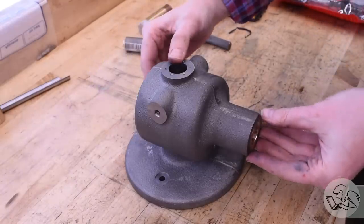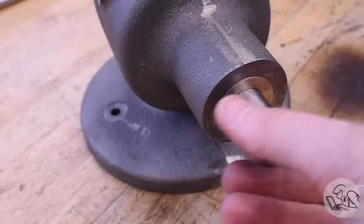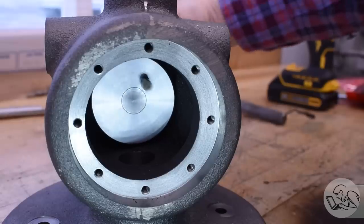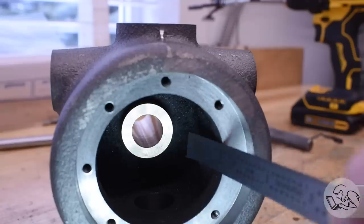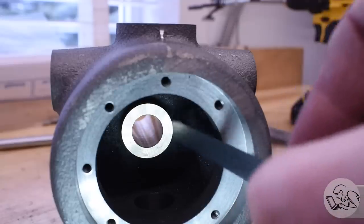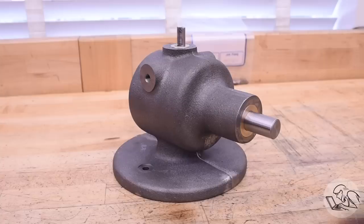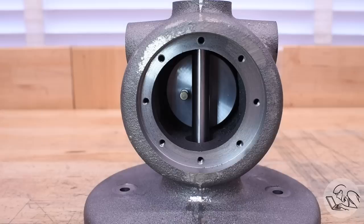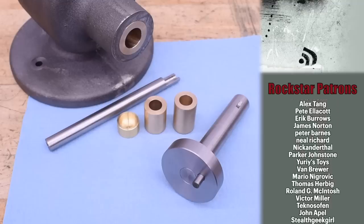Let's test fit the crankshaft — it slides in from the inside. Oh, that spins really, really nicely. I'm very pleased with that — it runs really beautifully. Gotta love machining. There's a view from the inside — you can see how that crankshaft is going to spin in there. The web is so large because it's also a support surface for the scotch yoke drive system, which will all make sense in future videos. Fun fact: this bushing is actually overly long on the inside — it sticks through the back of the casting because it also acts as a thrust surface for the back of the crankshaft. We finally got some pieces of the mechanism moving — crankshafts, file rods, bearings. It's starting to look like a machine. We're going to finish up the drive mechanism next time: the scotch yoke that causes the file rod to move up and down with the crankshaft. Thank you very much for watching, and thanks especially to my patrons who make all of this content possible. I'll see you next time.